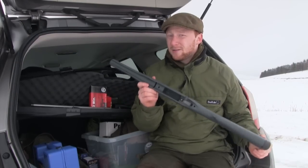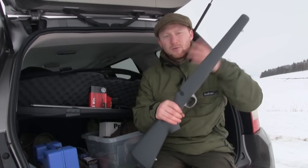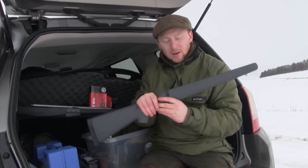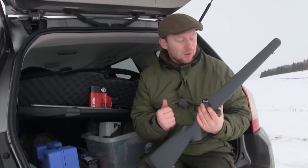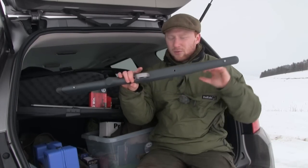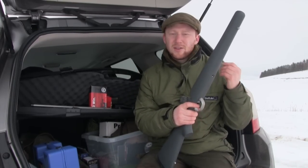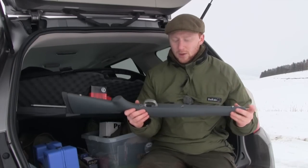You can't see this in the Kimber Montana, but it is in fact there. What Kimber have very cleverly done is when they mold this stock they mold it around an exact replica of the action of the rifle that's going to be bedded inside. That means from this point here, all the way to about an inch to an inch and a half past where the barrel starts, it is completely bedded and touching every surface of the metalwork — without having to add any extra resin, which is both a strength and a weight saving. The pillars are also built into the stock during the manufacturing process — you can see the bottom of them if you turn the rifle round.